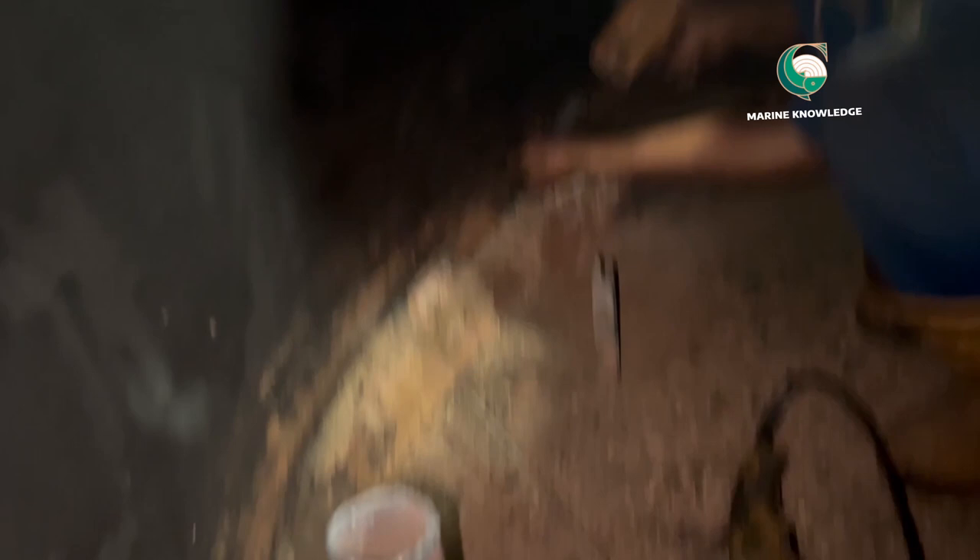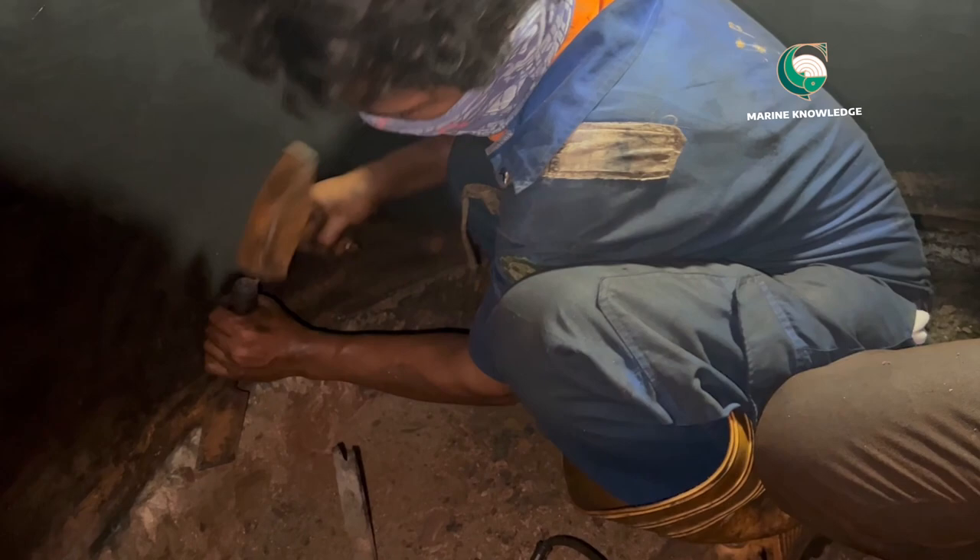We are in the process of renewing the entire refractory materials inside the boiler furnace area. Before applying new refractory materials, we have to clean and remove the old refractories and remove all oil stains completely. You can see we are removing all the oil-stained refractories. The reason we are doing this renewal is we had a leakage in the shell.